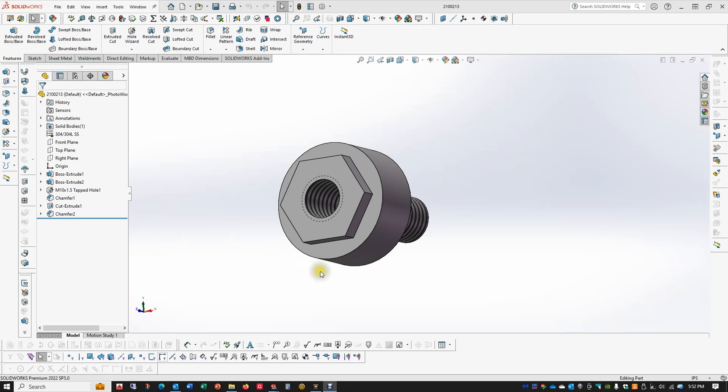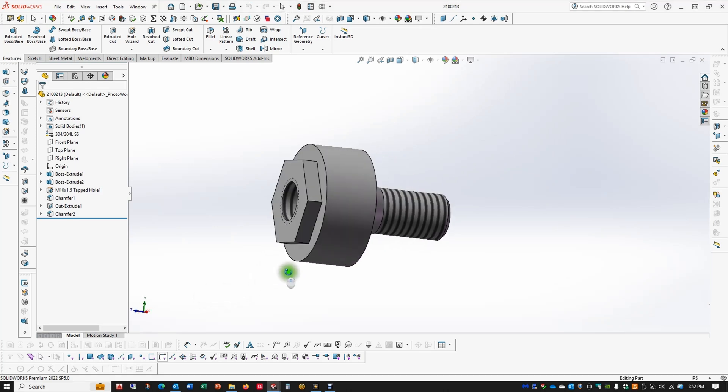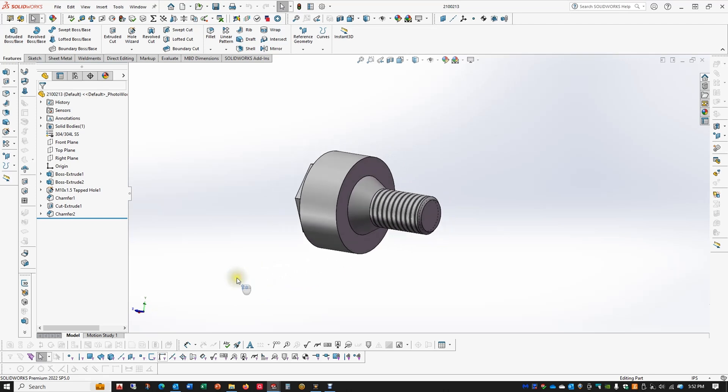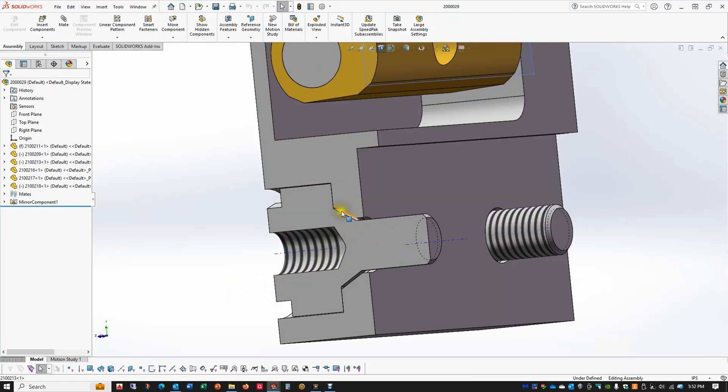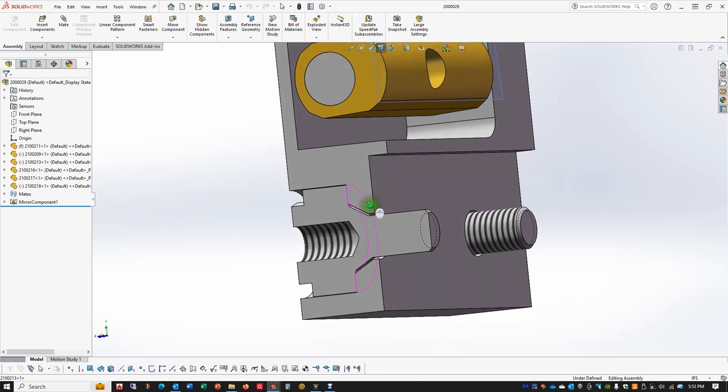Nearly there with this thing. Left to do is two of these bolts, and they look like this for a reason. Looking at the assembly in section view, it's done with a taper so that there's some meat around the end of the thread. You can make it with just a square edge boss, but then you only have a little thin web of material left at this end to support the bracket. In order to have enough space around this thread, you'd make the bracket thicker, but I want to keep the thickness to a minimum so we're not offsetting the follow rest too much.